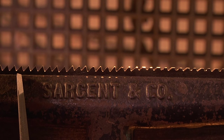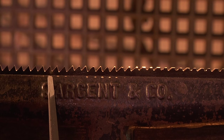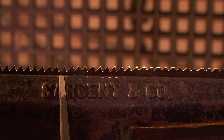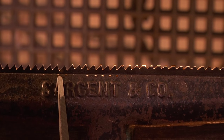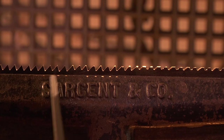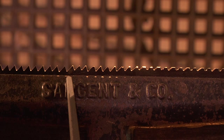These are the teeth on the saw that I've already filed. You can see that the gullet spacing is pretty close to the same, the depth of the teeth and the spacing looks very, very close to the same. It's not going to be perfect because the saw was so out of shape. It would usually take two or three sharpenings to get it to look anything near this.